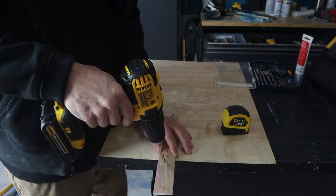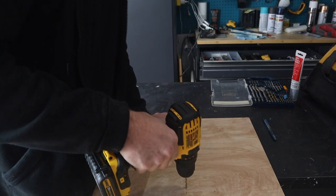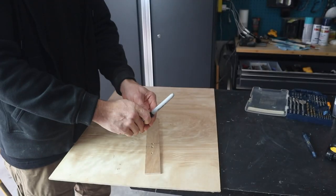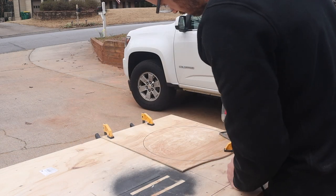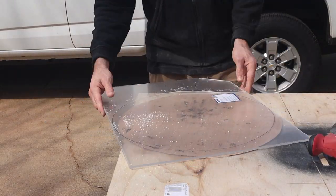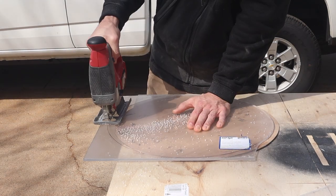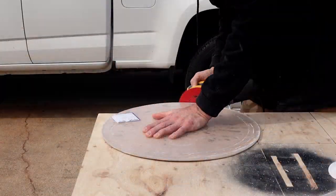We need to make a circular acrylic window. To do so, start by making a circle jig: drill one hole on one side of a stick and one hole on the other side, then drill a hole in the center of the board you want to use as your template. We cut it out to shape, making sure it fits in the porthole window, and when we feel we have it perfect, we proceed to cut it out of acrylic. We have to use a really slow speed — the heat can actually melt it, warp it, and congest your jigsaw. Then sand to finish it off.